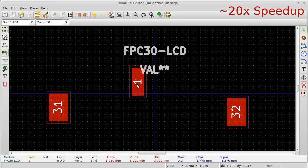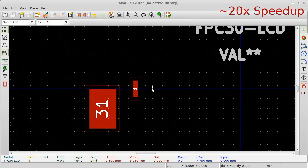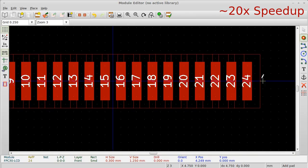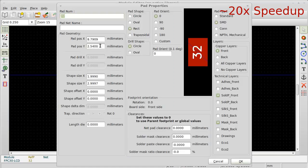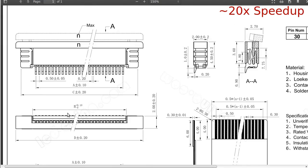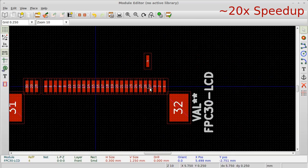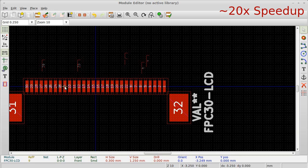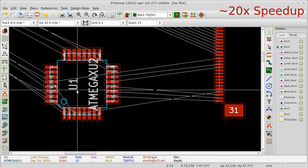Additionally, because this uses an FPC that I've never used before, I have to lay out a new design. This new design is done in the KiCad editor and it's pretty simple — you pull open the thing and you start; you'll need a calculator to figure out how to place parts and place little pads. Once you do, you get a pretty good idea of where everything goes, and then you lay out the pads. This is a footprint for the new FPC part. I actually messed up and got the pins backwards, so it takes a little bit longer than you'd hope, but overall it works out.